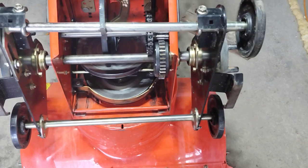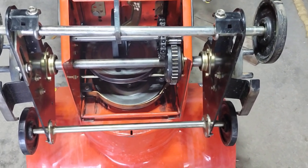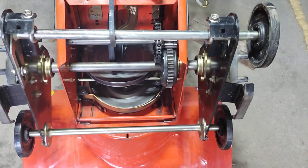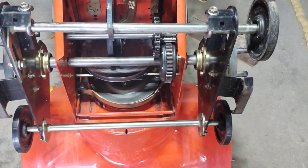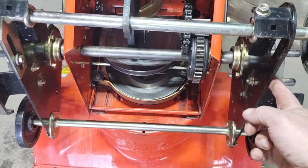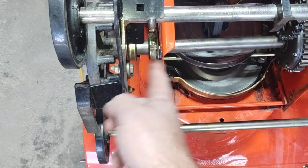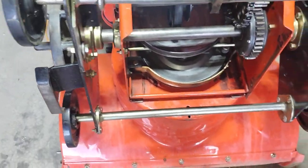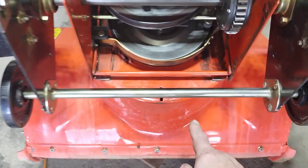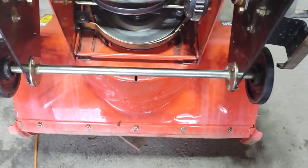This play was in here when I disassembled the bearings. I assumed that there was play on the axle shaft through the bearings, but that's not the case on the old one. It's assembled back correctly. You can kind of see this whole assembly — you've got the plate over here for one track and the plate for the other track on this side. The width between these two plates is set by this axle that is the axle for the idler wheels.